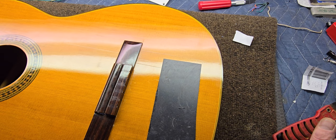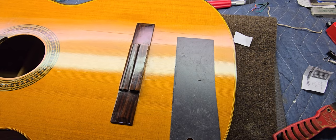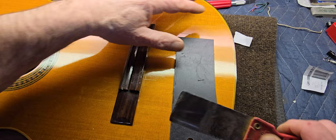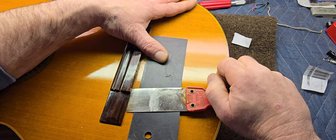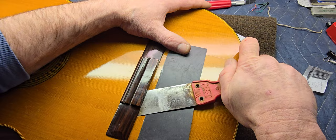My guess is they probably glued the bridge on to the lacquer — that happened a lot. They would lacquer the guitar, spray it all down, glue the bridge on it — not good. I know a lot of guitars that have come in with bridges lifting and that's the case. I just did an Alvarez from probably the 90s — same thing. Or they would scratch some of the finish off, but not all the way out to the edges. Just made no sense. I guess it must have sped things up getting guitars out of the factory.